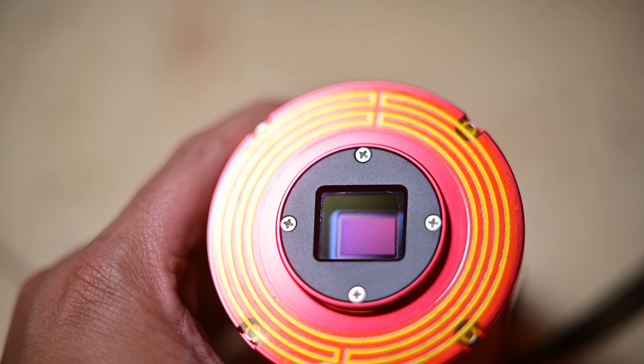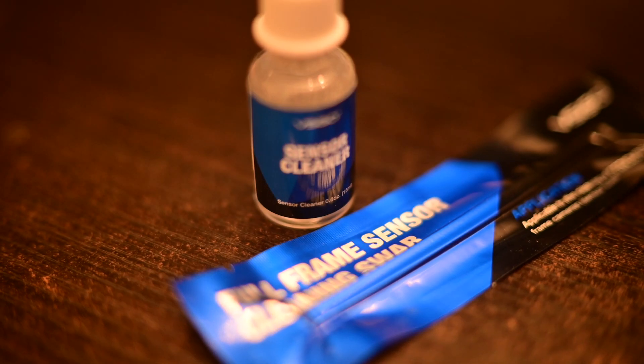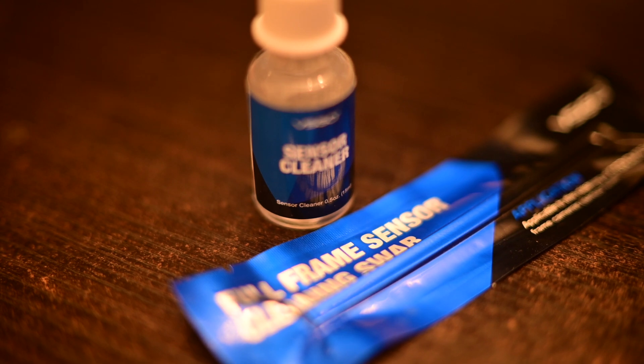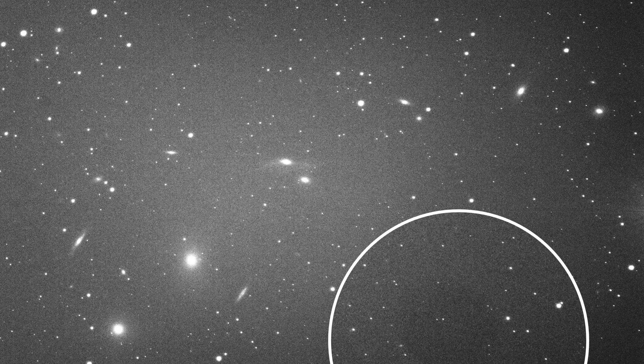When I was researching it, it seemed like people were cleaning it with microfiber cleaning cloths, t-shirts, q-tips — basically anything you could imagine cleaning glass with. That really confused me because coming from photography, you need a special swab and a special cleaning solution to clean the sensors in those cameras. But you really don't need that with these. And yes, you could calibrate all those dust motes out with flats, but if you don't clean your sensor at some point, those dust motes are going to multiply and be all over your sensor. I feel it's better to just remove them from the get-go. I've been cleaning my AstroCam this way for almost a year and no harm has ever come to it.